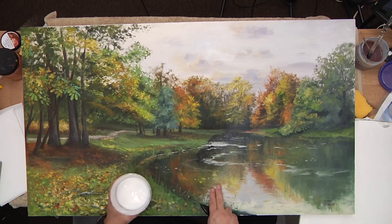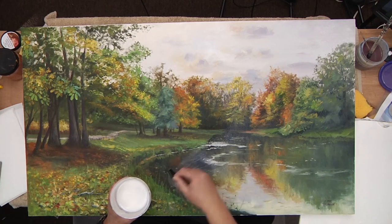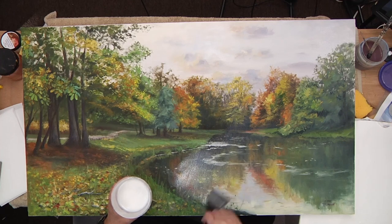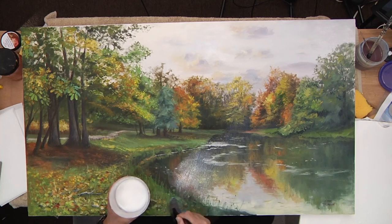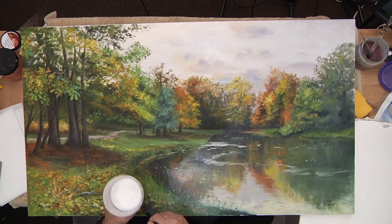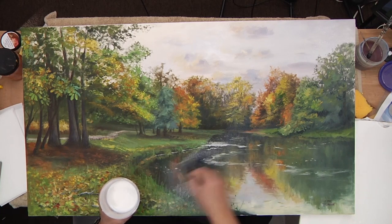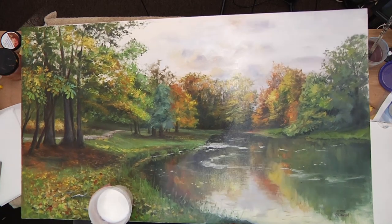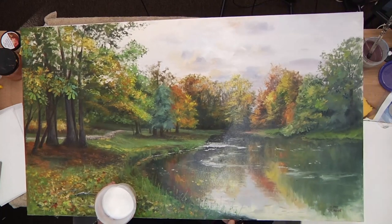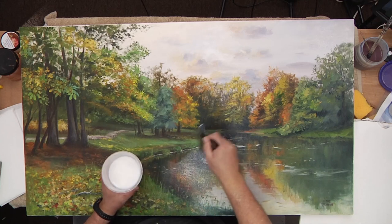Now over down here, it's getting a little tacky. So don't worry about it. Just put on a little more varnish, stretch it out like this. Stretch it and stretch it. Walk it right into that one there. If you're at all worried about it, you can lightly mist it with a little water, which thins the varnish just a bit and makes it even and level out a little faster. But this already, you can see it levels all out. See how there's no brush marks in it? And it's just a little bit cloudy because I had some water in it, and that will dry.